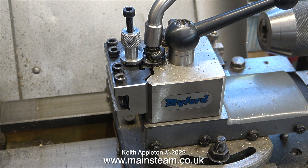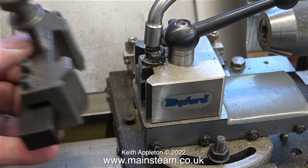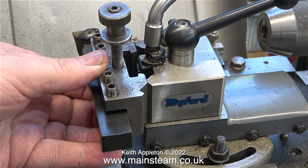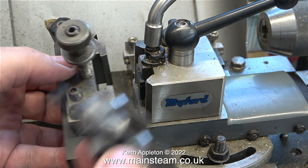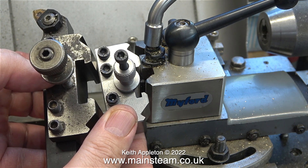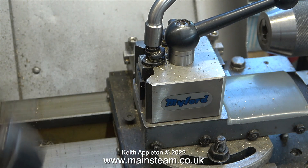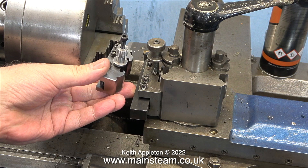The first part being a new tool holder for the Myford tool post. I try and use these quick change tool posts where possible. This for instance is the tool holder from my Smart and Brown lathe - as you can see it's much bigger. I do like this system; it used to be called a Dixon tool post but the patent expired so there are many different ones. This tool post on my Smart and Brown lathe is a genuine Dixon tool post - more or less the same as all the rest except a lot older and bigger.